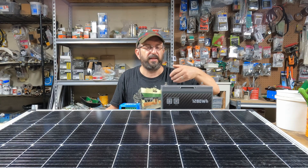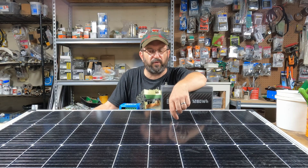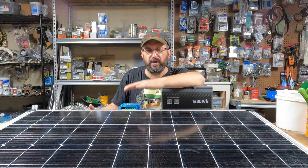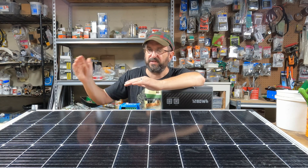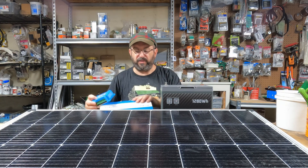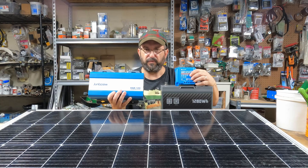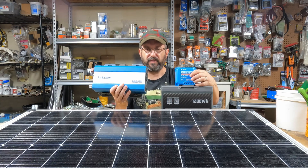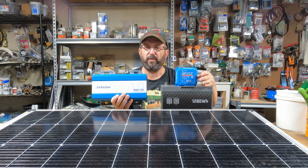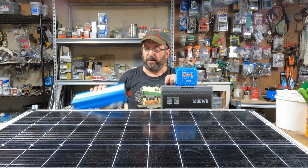Get this battery — just get as many as meets your need. With the solar panel, CalSun — get as many as you need. If you're building a 24-volt system, you're going to need a couple in series. If you're building a 48-volt system, you're going to need even more in series. Remember, 48-volt is not 48-volt — you need solar input of at least 60 volts coming in to charge up those batteries, so you're going to need four of these or so. These four pieces of equipment are the best in the business. If you're building a 24-volt setup, replace the 12-volt inverter with its big brother the 24-volt one. And if you want a 24-volt low-frequency build, just replace it with the SunGold Power.